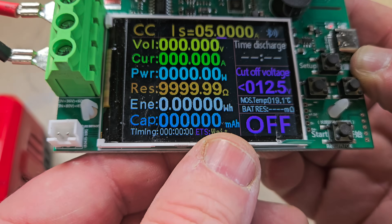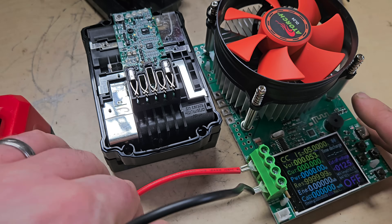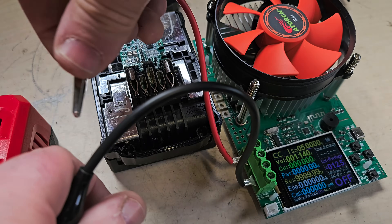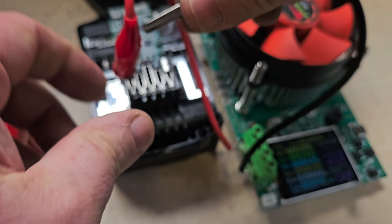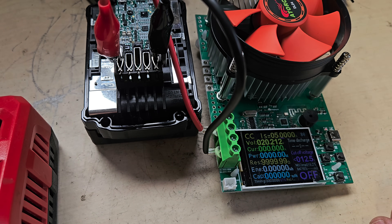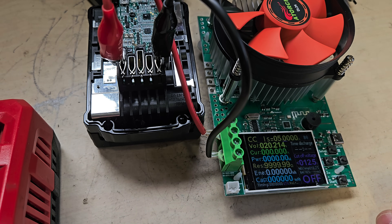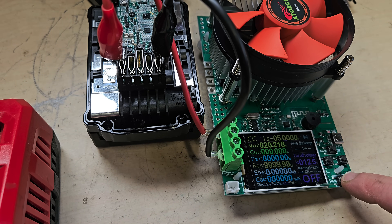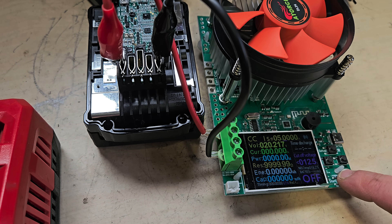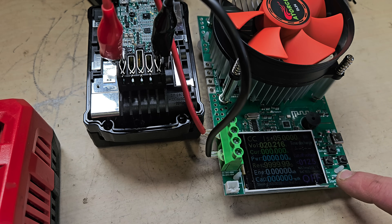And the milliamps - the capacity - that should be 5,000 milliamps if it's as good as new. Any shortfall in those two numbers shows loss of performance. I don't think it's due to use in this case - I think this battery was stored somewhere and forgotten about. It's really to do with what the voltage recovery of that middle bank of cells will have done to it. So we'll give it a whirl. This is quite a harsh test - if these cells are weak, it'll either destroy them or they'll be forced lower than the rest. So we'll start now.